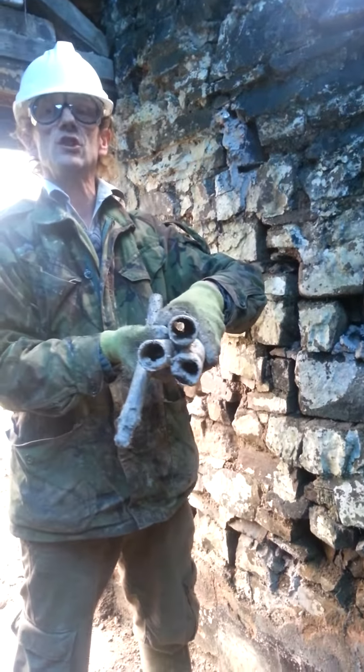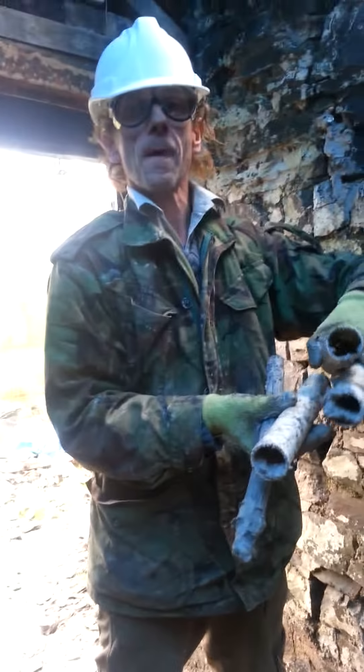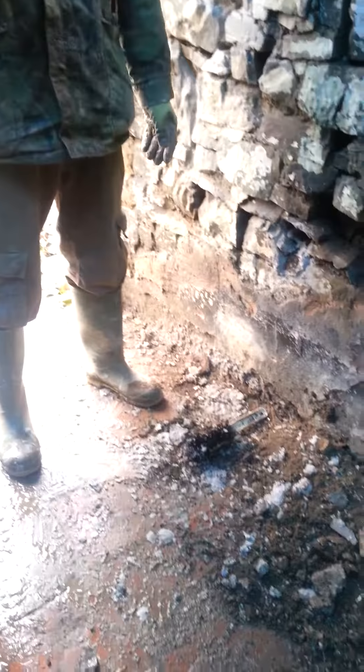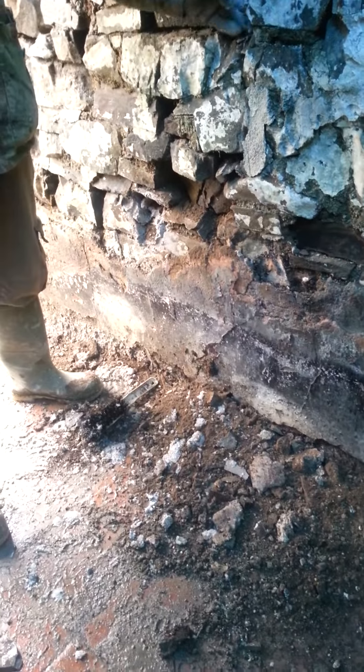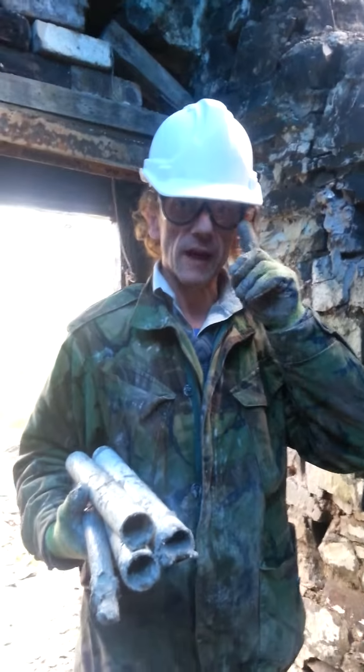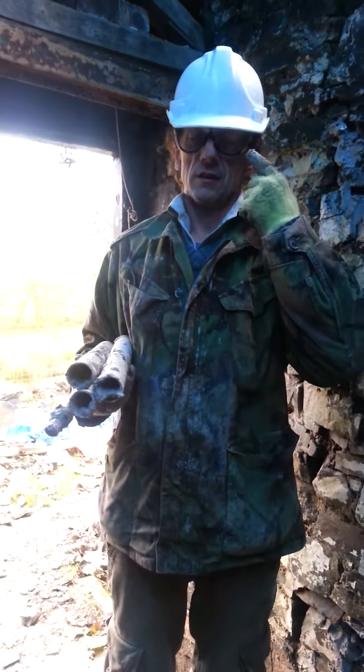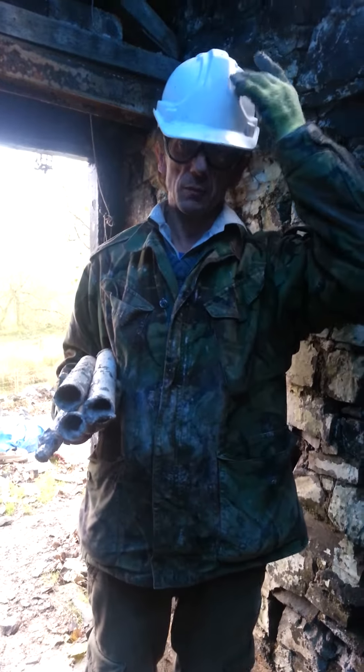You need to point it nicely. There's a bit of residue left in there, but a lot less waste — not so much on the floor. Sometimes when you do pointing you can get a lot more lime on the floor when you've got big holes to fill in. I advise to use goggles — always use goggles, because the other day I got a splash and for three days it was stinging me. And a helmet, because you've got a lot of loose stones up there. Jane hasn't got a helmet. But then she's got the brains.